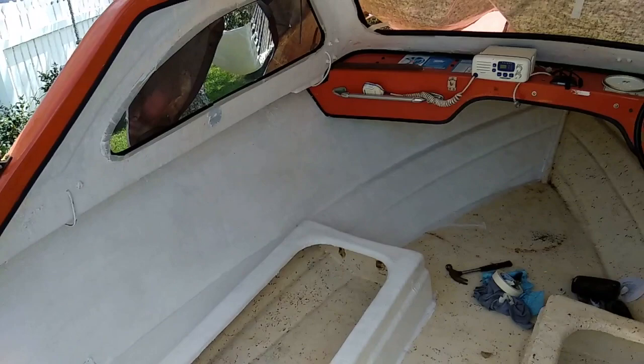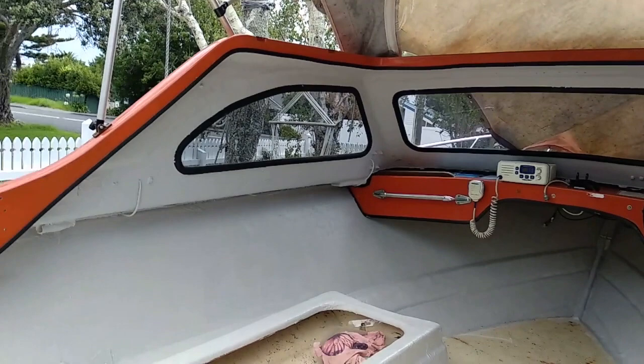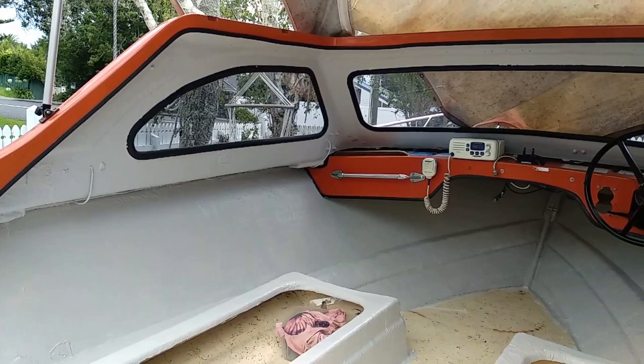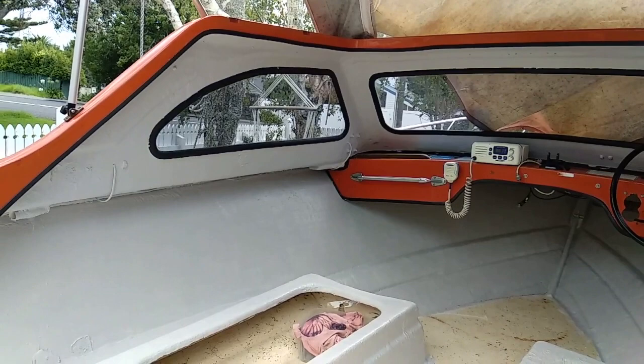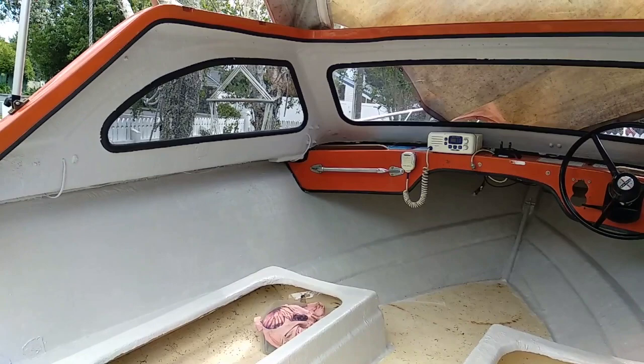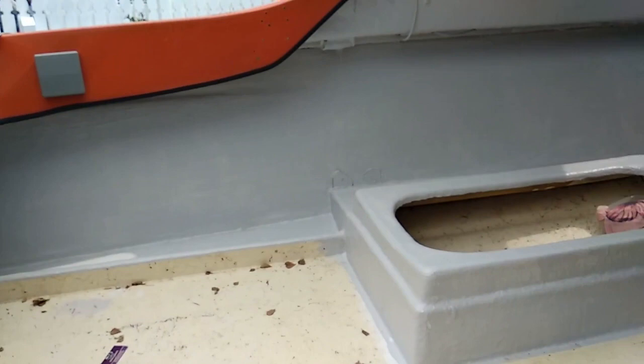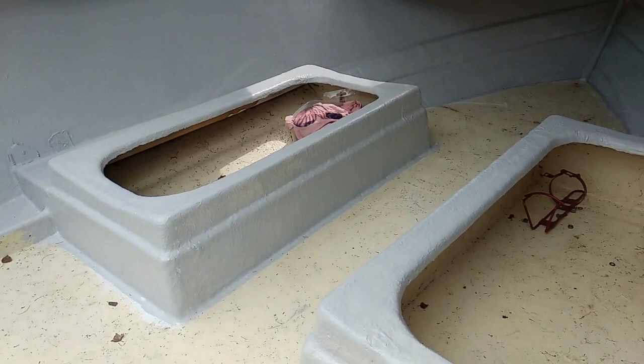The first top coat is on. I started using a brush, finished the top area — two coats on there really. It was a bit tricky masking with the vinyl as the masking tape wouldn't stick to it, so I did as best I could. Now I'm going to mask the paint and clean up the vinyl because the paint will come off that pretty quickly, so we should get some good lines back. The bottom half has had everything done with one coat already, but a second coat really gives it a good strong layer that will bond and hold for the life of the boat.